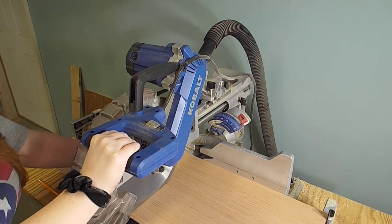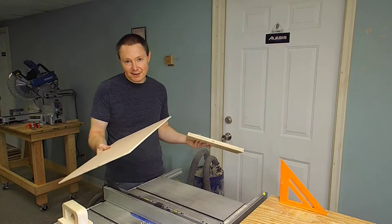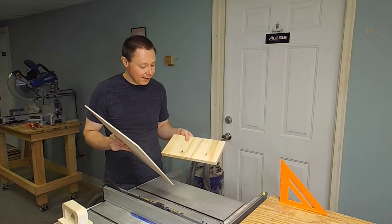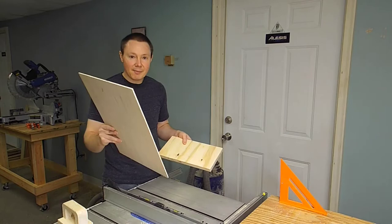All right, now all the parts for our drawers are cut and almost ready for assembly. I'm going to tell you why we oversized these bottom panels just a little bit. That's because they're going to dado into the side panels, a quarter of an inch deep into each panel. Now, this bottom panel is about 3/16 of an inch thick, so it'll take a blade width and a half to get the dado cut. And we're going to start a quarter of an inch up from the bottom.